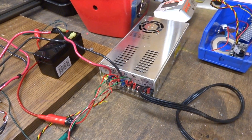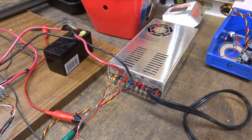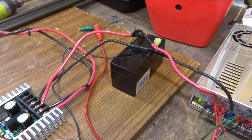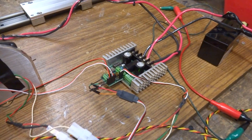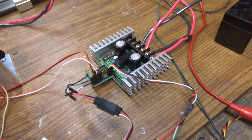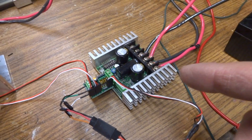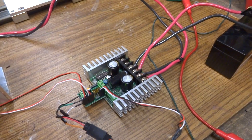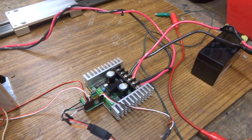It supplies up to 30 amps, and when this thing gets rocking, it can pull up to 30 amps. But that is going to go away. That's just a battery for the regenerative power that this Sabertooth motor controller dumps into. This version of Sabertooth — I can put a shunt in there, a power shunt, and get rid of that battery. I won't have to dump it.